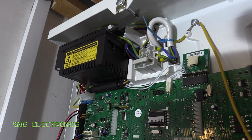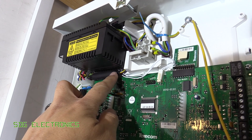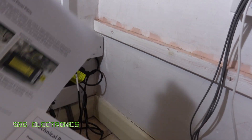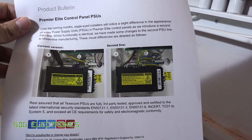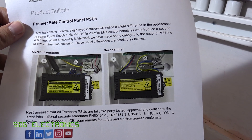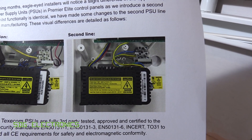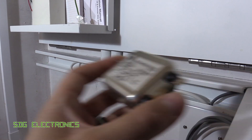You can see if you look underneath the switch mode power supply there is actually a choke on the wires going to the PCB, and there's also some filtering on top as well. They may also be changing the design of the power supply — the one on the left is mine and has a choke on the output wires, while the one on the right doesn't have those, so they must have redesigned it to incorporate additional filtering inside.